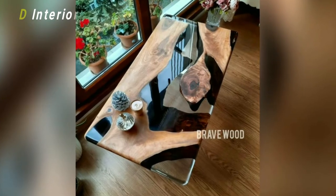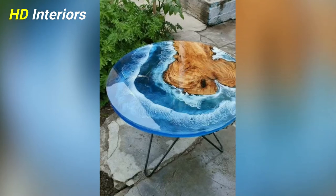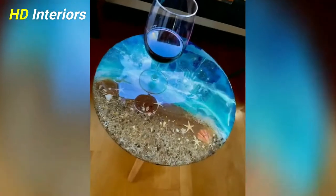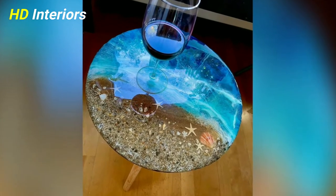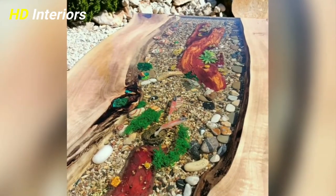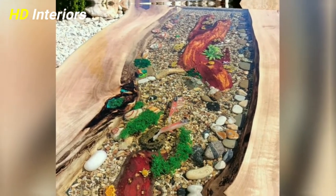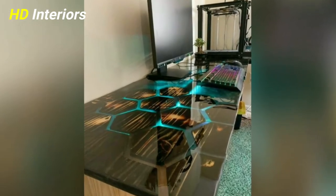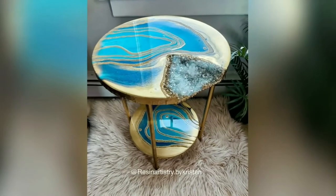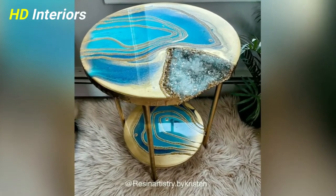It is very important that the environment in which you work is a dry, heated room with a temperature of around 20 C during the entire process. The resin must also be at room temperature, so if it is delivered cold or if it has been in the garage, you should increase the temperature to a minimum of 15 C before use. Damp or cold conditions affect the end result. Also, the room should be as dust and dirt-free as possible to ensure great results.